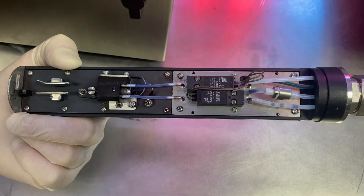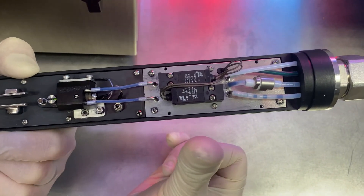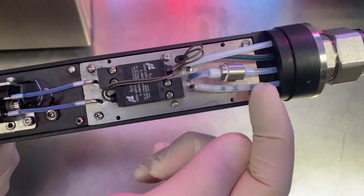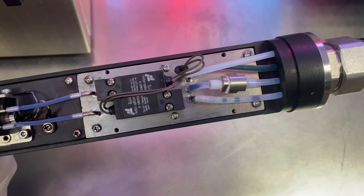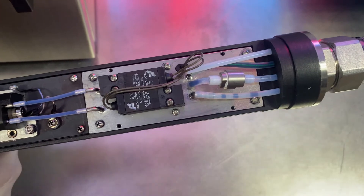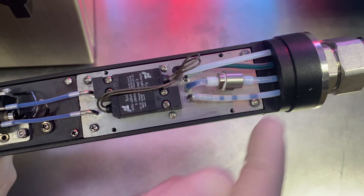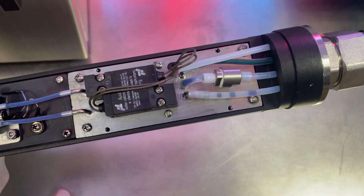One of the symptoms we discussed earlier — a visual symptom if there's an issue with our bleed or back flush circuit — is if valve three sticks open. What you would see in that scenario is fluid always kind of pushing up the bleed line. That can cause pressure issues at our printhead and print quality issues subsequently. So if you ever see fluid pushing up the bleed line when you're jetting normally — once the inkjet is active and the printer's ready — if you still see fluid traveling up this line, that's not good. The culprit would very likely be valve three, and we will discuss how to troubleshoot that.